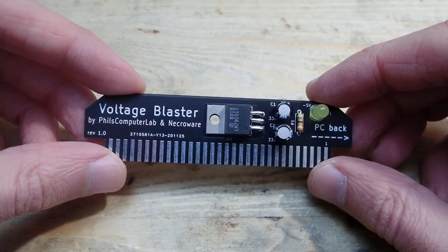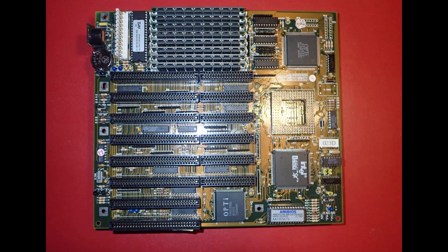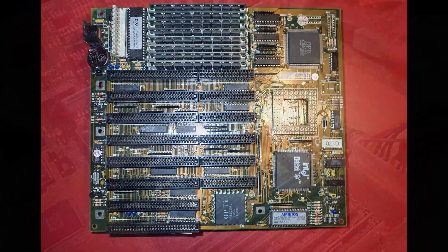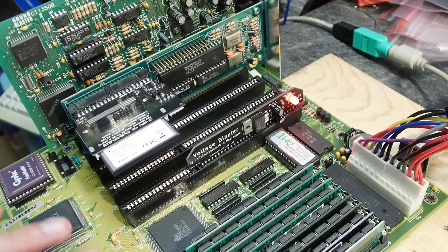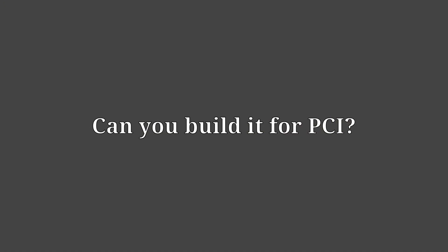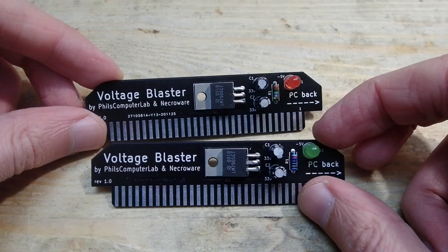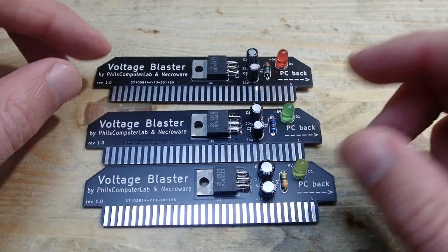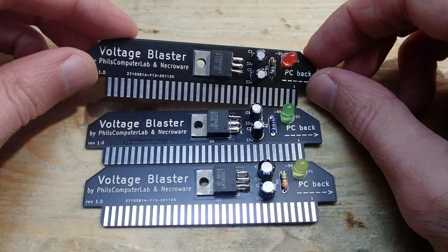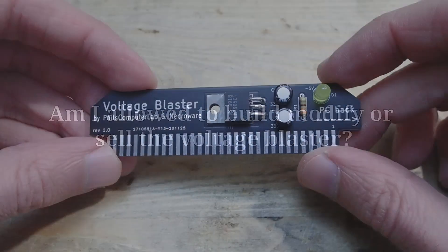This is something you really have to take into account, but usually you have up to eight ISA slots on old mainboards, and I almost never had a machine where all slots were populated — at least one 8-bit slot is always free. But I can imagine that in some cases it could be a problem, and then you'll have to search for another solution. Can you build it for PCI? No — the PCI specification doesn't provide minus 5 volts. Why didn't you use SMD parts? At least for my projects I always try to use through-hole parts since I want to make it easy to build. I solder SMD quite often but I tend to make my projects beginner-friendly so they can also be built by people inexperienced in soldering.